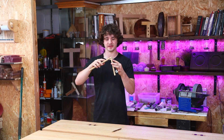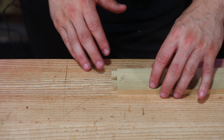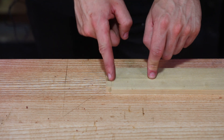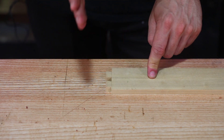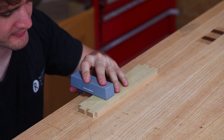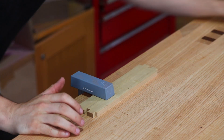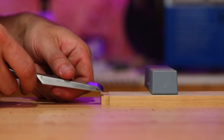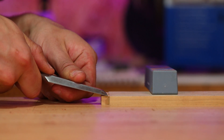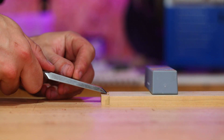What I like to do is protect against that potential slipping and get the pieces perfectly aligned when you're about to trace around them. I do that by adding a little v-groove on the back of the tails. In part two of this dovetail box project we made the marking gauge line very deep on the back of the tails — that's to create this v-groove. Clamp your piece down, get a chisel from the tail side, angle it up, take a little section out up to that marking gauge line, and it just pops off, creating a little v-shaped groove.